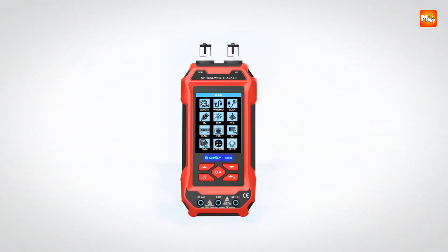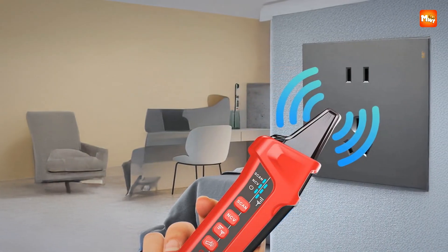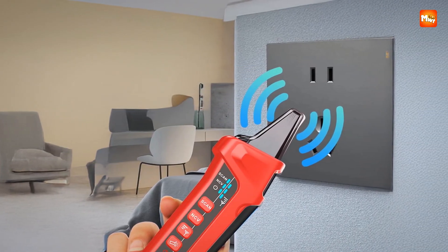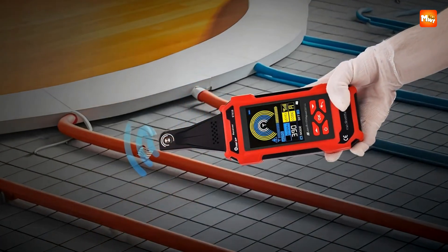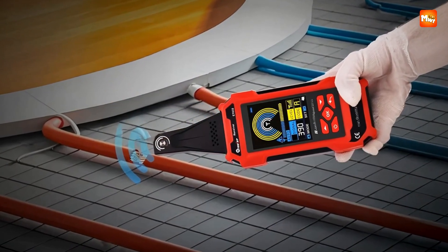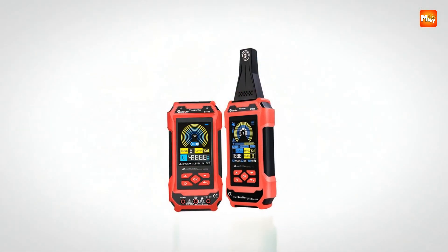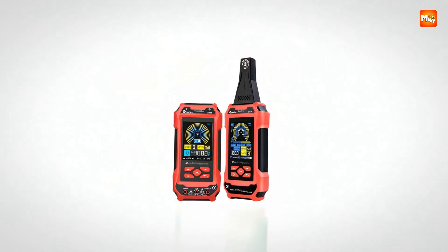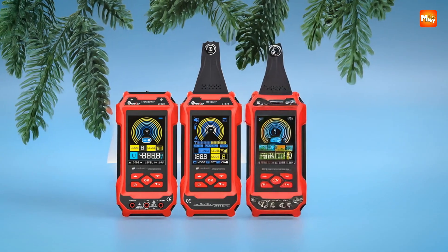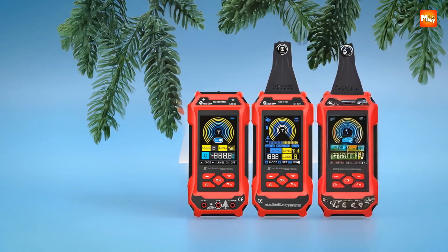On the digital side, the noise-free cable tracing is a lifesaver in messy environments filled with interference. With adjustable sensitivity, you can quickly find the target line whether you're working on RJ45, BNC, or telephone cables. Thanks to the switch flash function, you can identify live ports at speeds from 10M all the way to gigabit. The PoE test adds another layer, giving you polarity and voltage details so you know exactly what kind of power is flowing through your cables.